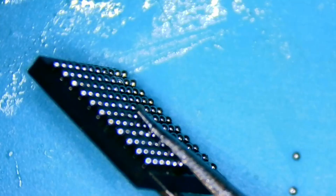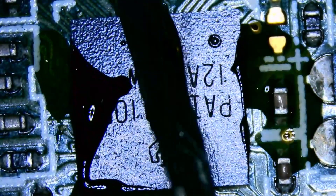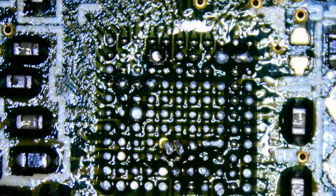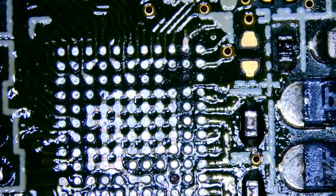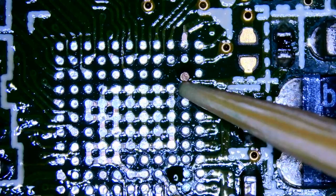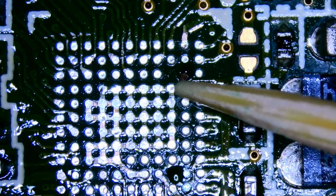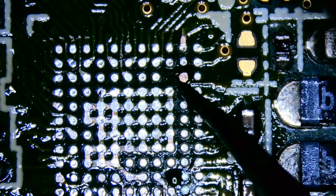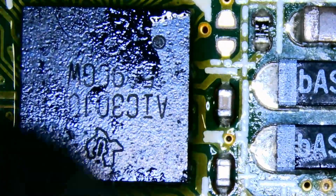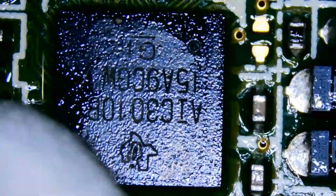Look at that — I think it's good. Going to remove the one from the noisy device now. Hopefully this makes a difference, otherwise I've wasted a few hours trying to re-ball that chip. I was potentially a bit too reckless with removing and cleaning that, because I've lost two pads. Luckily those pads don't actually connect to anything — they're just ground ones. I am going to put little replacement pads in place, because I've got the balls on the chip and I want those balls to have something to stick to. I'm just applying a bit of solder mask to the back of the pad and then sticking the pad in place. Moment of truth — we're heating the new chip up, putting it in place. Seems to be all good. It did its little flux dance.